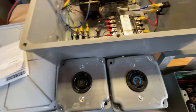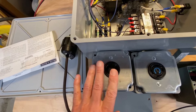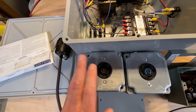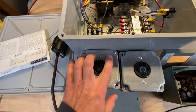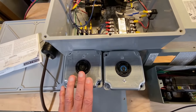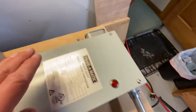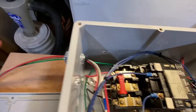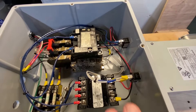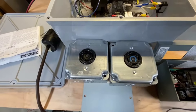Why two outlets? The one on the right is the bonafide three-phase outlet. The other is a very similar three-pole with a ground — it's actually a 2-to-3 wire configuration. In terms of current carrying capability they're identical, but the width and exact configuration of the slots is slightly different, just to make sure you don't plug the wrong thing into the wrong power. Since many people use the left one — like this grinder I bought with the plug already on — I included it, but I'll mark it very clearly with a prominent color indicating it's three phase, not 220.